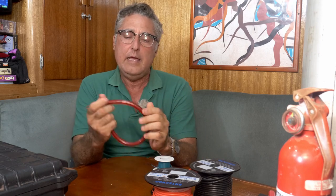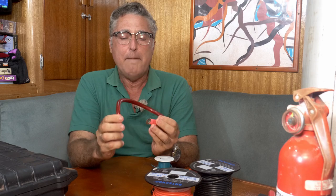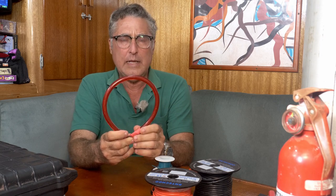There are a lot of different wires available, particularly lately. Historically, most wire was copper and it should be copper. Barring silver, copper is really good. But watch what wire you're buying. Nowadays aluminum is cheaper and they're making aluminum wire. Aluminum wire can be used, but for a given size its resistance is much higher. It melts at a lower temperature, and most importantly when the wire corrodes it makes an aluminum oxide finish that is very high in resistance. In short, it has no reason to be on a boat.